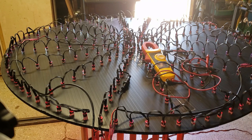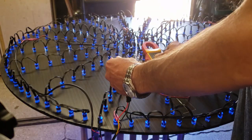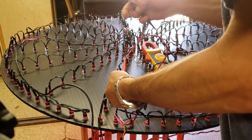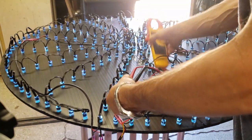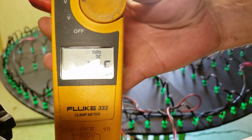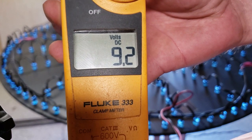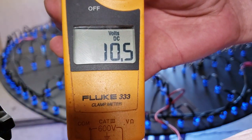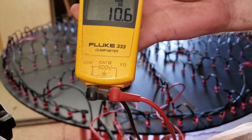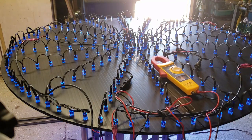And the net result of all of that — as you saw, the 5.9 volts — if we check now at the very end here, you can see I'm at the end. I'll turn on my trusty voltmeter here. I now, at my very lowest point, hit 9.2 volts, ensuring that I have even power across all of the pixels, making sure that at the very end it's not dimming or flickering anywhere within the prop. All of it has equal power. And not only that, it gave it additional ground, which I'll be talking about here in a few minutes.